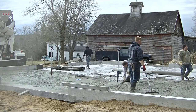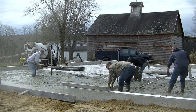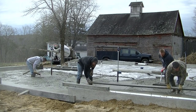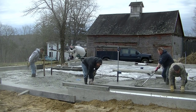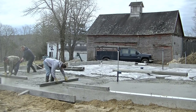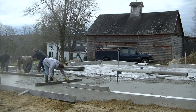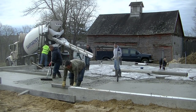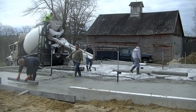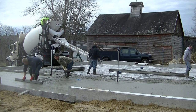What I'm doing is shooting my grades — that grade right there is level with the outside edges, and then we're going to tip it down to that floor drain. That floor drain's got blue tape on it in the middle; it's going to slope down an inch. So what we're screeding right now is just level on the outside, and then I'm striking the pad from the outside edge down to the drain, sloping an inch. The middle section slopes to that one drain, and then there's a high point right in between those two drains, and we go back down to the middle drain. It's a little more intricate than just pouring a regular flat concrete floor.